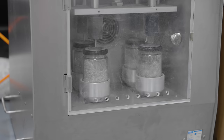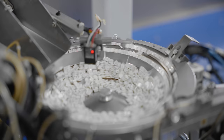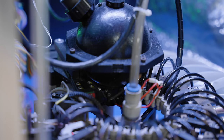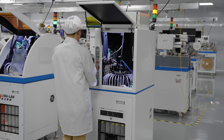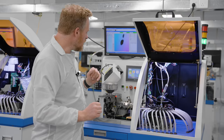This is an automated LED testing machine, and it's quite cool in its design — it uses a bunch of relatively off-the-shelf parts used in all sorts of manufacturing lines for small parts. They're testing several things: does the LED turn on at all? Do the red, green, and blue LEDs light up? Does the smart chip work correctly, both for turning on the LEDs and for sending the right signal out? And they're also testing color accuracy — are the red, green, and blue LEDs the right brightness and right color?